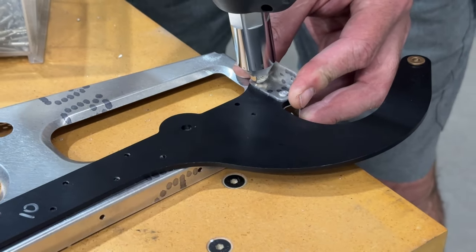I took my combination square down, put a mark where this surface is on the table, measured over — it was 19 and 7/8ths here — went over there, marked 19 and 7/8ths, brought my combo square over and slid the rib to it. Because this table is cut very square, I was able to use it as a reference. Once I got it square, I came back and noticed a slight gap here. One thickness of shim seems to have done it and that's holding it square. I had to leave the rear ribs unclecoed to get the clearance I needed to drop the truss in place, using a couple quarter-inch AN4 bolts to hold it while I was working.